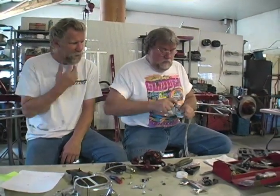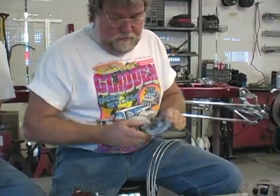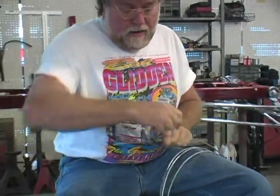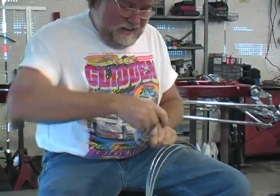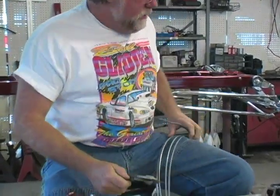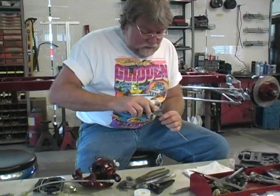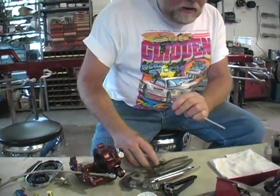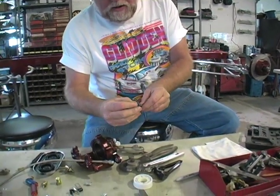This is how you use your cutter. You tighten it up and spin it around — don't put a lot of pressure on it that way. You don't smash your tubing on the inside or pinch it too tight. What you want to do after you cut it is take your end and open it up to make sure that your little fitting pin will fit into that.